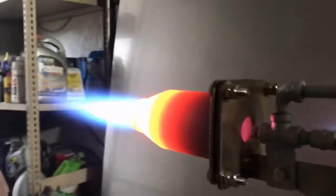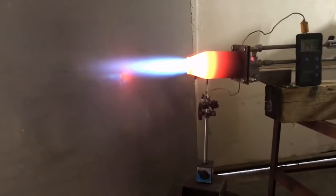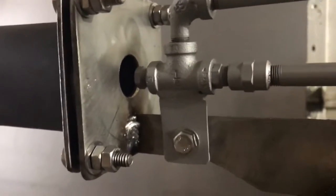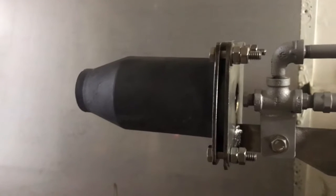What's up, fellas. We're going to be looking at some modifications of this silicon carbide micro burner — it's a high velocity burner. We're doing a propane test and we've seen some drastic temperature increases from this modification. This is another test of the silicon carbide nozzle — the smallest one I sell. We're looking at a different intake port this time; I've doubled the size to see if the turbulence benefits ignition. We had some very strange turbulence with the smaller hole, and I feel there's some undesirable turbulence due to that small venturi space. We're going to check this out on propane today and also get a calibrated reading on fuel consumption for the oil burner book I'm writing.